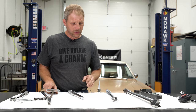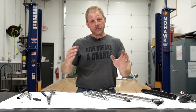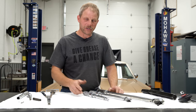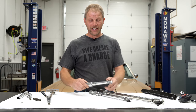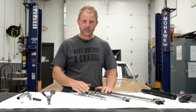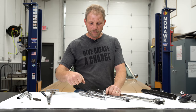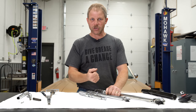Now to move on, we have an array of wrenches. Just as our jobs require different amounts of torque, there are also torque wrenches designed for specific ranges — meaning you have an inch-pound wrench, a foot-pound wrench, and then a really large foot-pound torque wrench. This style of wrench is considered a clicker wrench. It gives you positive feedback: as you reach the torque you've set it to, it kicks over.